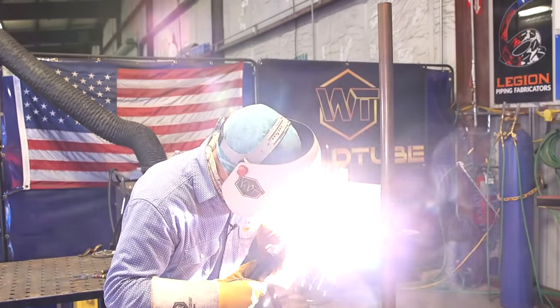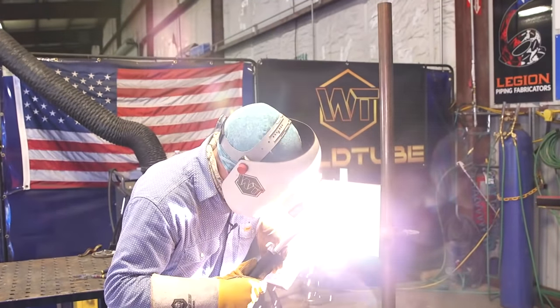Make sure you're fusing on the side to the parent metal. If you start going side to side too fast without fusing on the sides, you're just going to eat up the bevel without depositing enough metal, and that's going to leave undercut. So as you come out to the side, pause and let the wire deposit to fill in that gap. Swing to the other side, pause, let it fill — that's the rhythm.